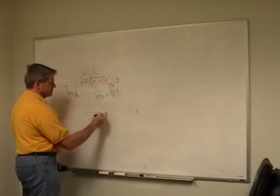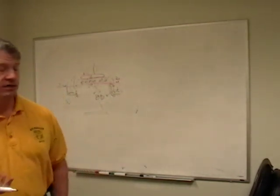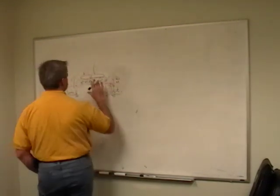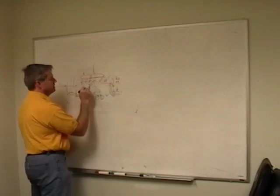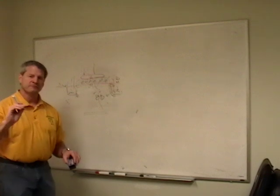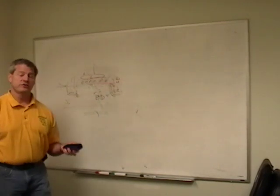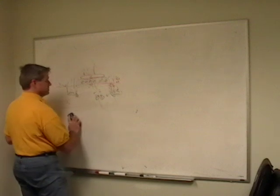Turns out that newer processes... when I first learned, 5 and 2 microns was a new process, or relatively new, and they could only handle a certain amount of radiation. The new ones, because you're running lower voltages, you've got to get this gate much closer to get the field intensities you need to modulate the lower voltages. So your field oxide is much thinner, and that means there's much less likelihood that you're going to trap charges in there. And if they do get trapped, it's easier for them to go out. So for a lot of the newer processes, the radiation tolerance has gone up, at least for total ionizing dose. So that's good.